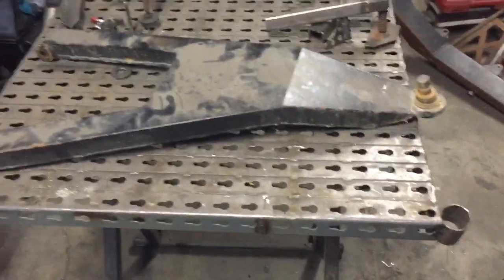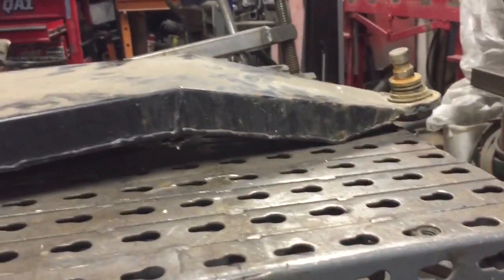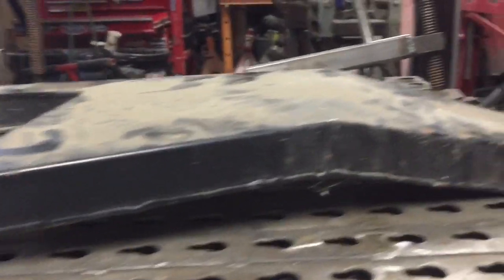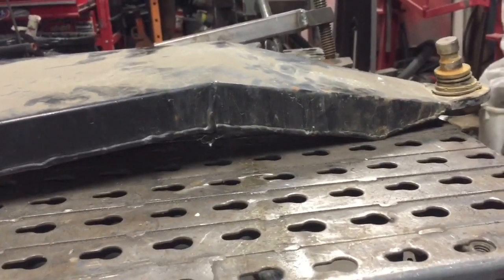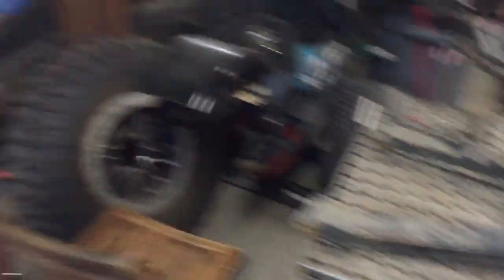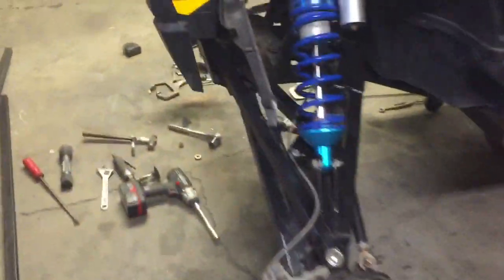Here's what I'm going to do: since you're only getting about a little over an inch more of clearance by doing it this way, but you're also taking away a ton of strength in this area. And to bring the strength back, it's just easier to do with tubing. But since we're doing this with blocks, I think I'm just going to build them straight — not going to worry about an inch of clearance. This is more of a short course or desert racer anyway, not really rock crawling or anything needing that extra clearance. So we're going to build it strong. It's time to rock and roll.